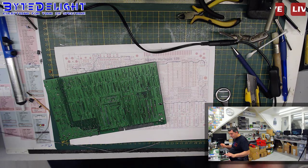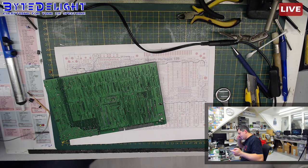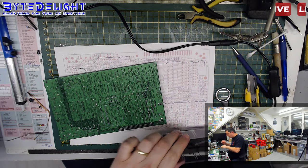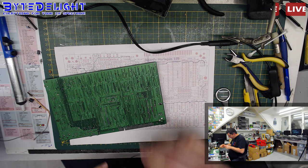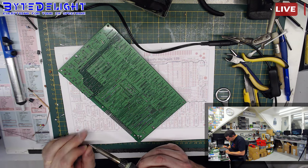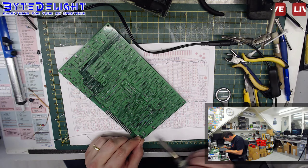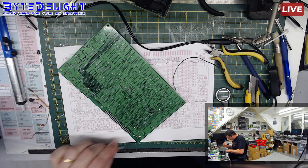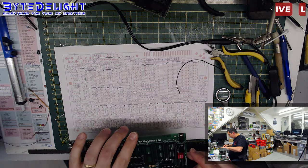So, now we need a jumper wire, which is of course obviously not an issue at all. I usually use very thin wires, but for this, because it's a power line, I will use a bit thicker wire. Of course. Board doesn't consume much, but still. Alright, let's cut it. And it's soldered to the SMD position for a capacitor. And now I'm certain that we have 5 volts again.